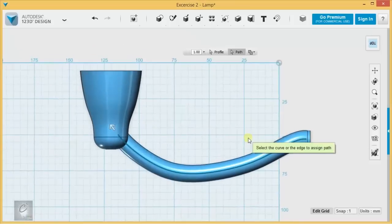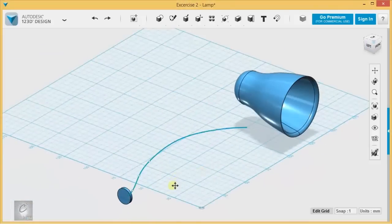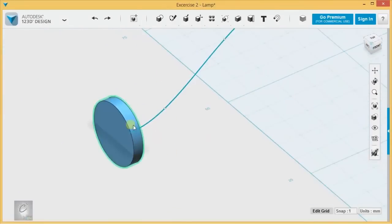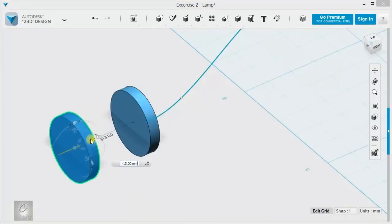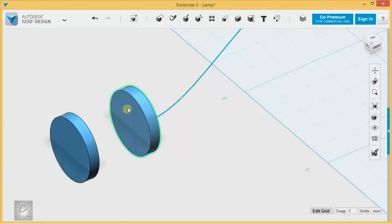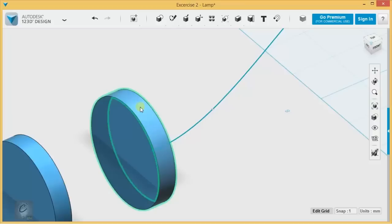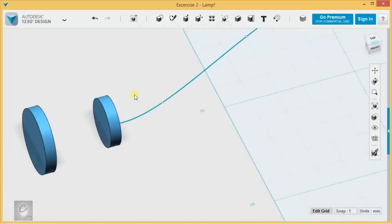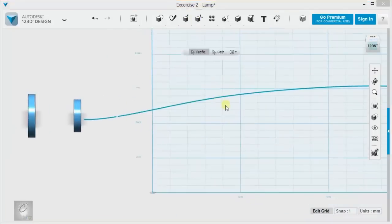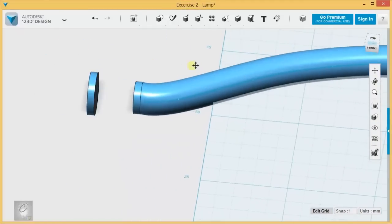Let's look at it from the top. I'm going to extrude that in pretty soon. One thing I'm noticing — it is a little bit wider than I'd like it to be, so I want to reduce the radius of this disk a little bit. But not before I copy and paste it because I want to use this for a little bit later. I can use press-pull on the side of a cylinder and just drag it in — that's actually going to reduce the radius by a little bit. I'm going to re-sweep the profile across the path like that, and I'm pretty much good there.